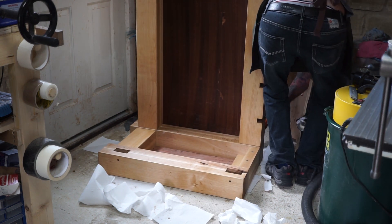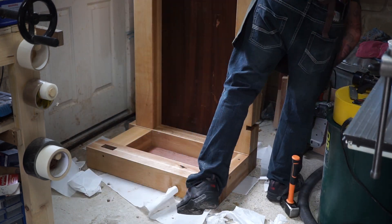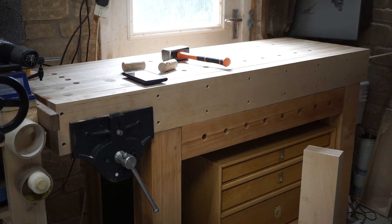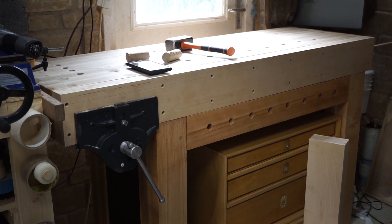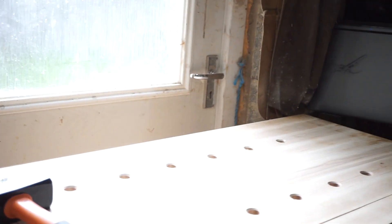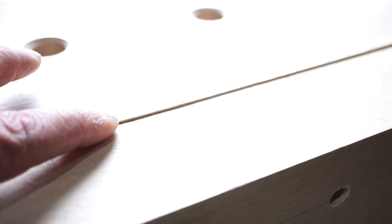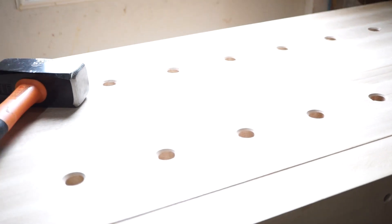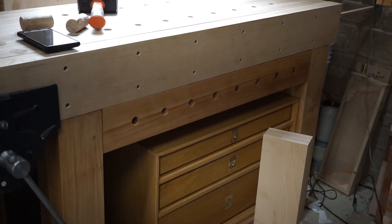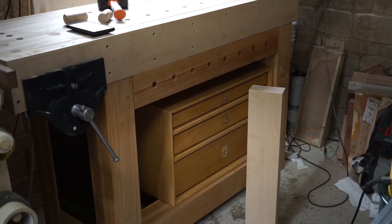Off camera I mount the vice to the bench top with 12mm coach bolts, countersunk and plugged with 35mm dowels made in the same way as the draw bore pegs. So the base is together, the drawers are back in, I've got the bench top on top of it with the front apron mounted. The bench top isn't bolted down yet and I made a bit of a mistake when I cut the front apron — I read the numbers wrong and cut it too thin rather than too thick. I've got a slight lip here which means I've got to re-plane the entire surface again. But other than that, the bench is absolutely rock solid and I think it's going to serve me well.